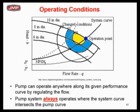Here we have a system curve crossing over a pump curve. That little blue line — that's where it's going to run. Always. It's going to be at that point. First law of thermodynamics: energy in, which is the pump curve, and energy out, which is the system curve — where they cross is going to be equal in energy. You can't change that. You can't specify that on a drawing. That's what's going to happen in the real world, and that's where we have to look at pump efficiency.